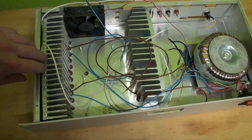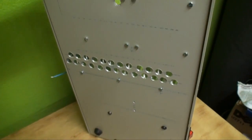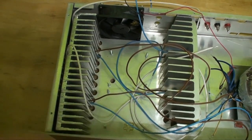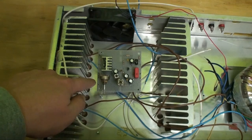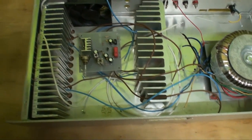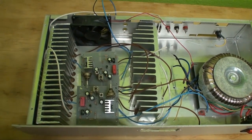I did a whole lot of drilling in this housing. As we flip this out, lots and lots of holes — for everything. The driver boards are going to go into the center, in between the two heat sinks. One is going to go in so that all the transistor-related connections are on this side, getting very short connections to the heat sink. Consequently, the other board is going to go in the other way — once again, just a short distance to the transistors.